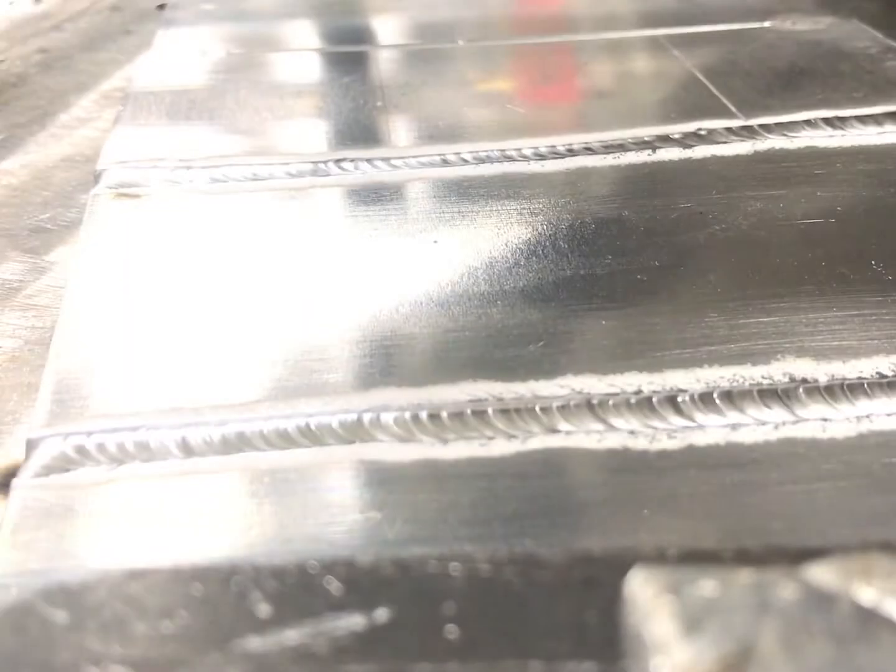What's different about aluminum is the fact that you actually have to control your foot pedal. Whereas when I teach TIG to beginners, I'll tell them just to set their machine to a specific amperage because it's a lot easier — they can just hammer down, take one of the moving parts out of the equation. But here it just doesn't work that way. The thermal conductivity of aluminum is about three times or more that of steel or even possibly stainless.